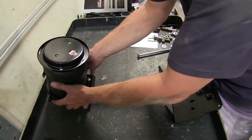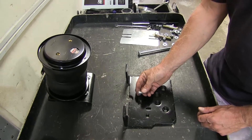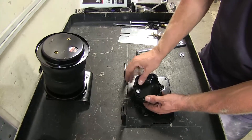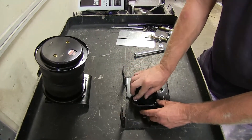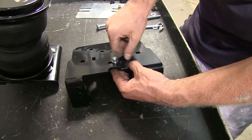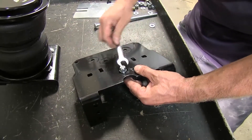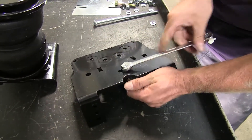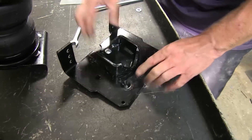I'm going to scoot this to the side for now and work with this plate here. We're going to install a very short 3/4-inch bolt through this bracket like so. With these ends pointing up, this will sit in there. Add the matching washer and then the lock nut. I just want to snug this down so I can still move it around — I'm using a 1/2-inch wrench for this. We need to be able to move this around so we can install hardware, because some hardware will be trapped when it's in its final position.